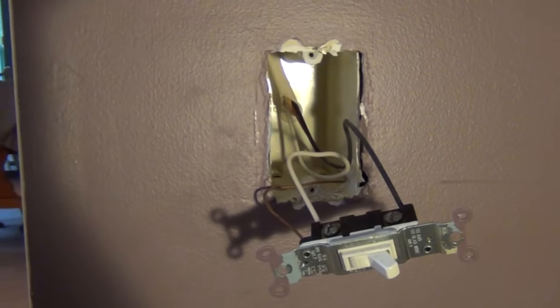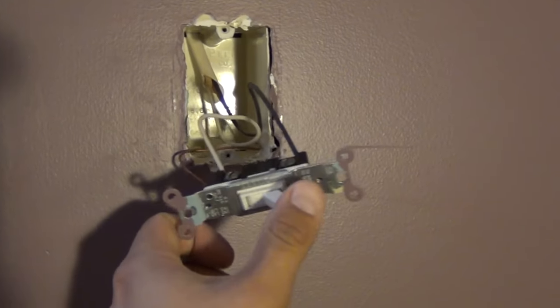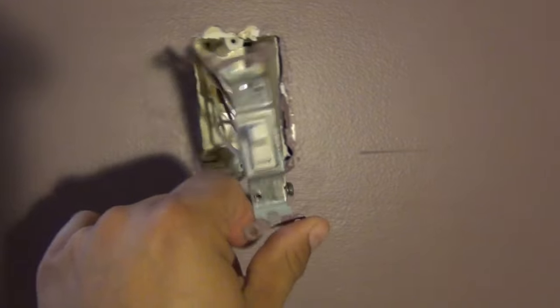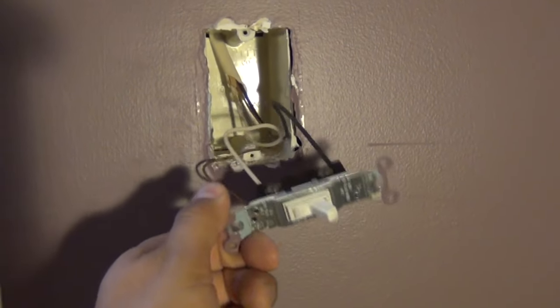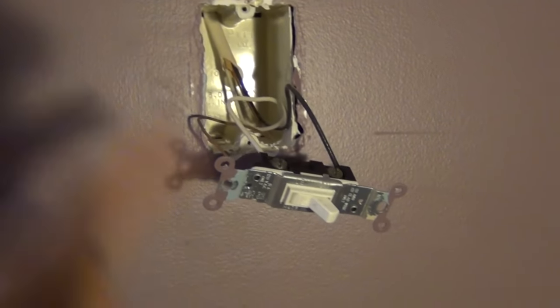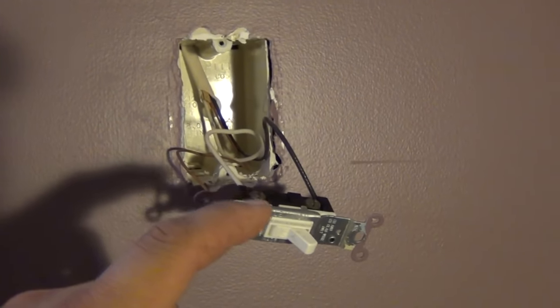So what exactly is the problem with the current configuration of this circuit? What we have right now is a single piece of Romex coming out of that outlet box down there. The way this works now is that this switch, when it's off or on, is controlling power down to that outlet. There's no lighting in the ceiling, and current code requires a switch in every room that could control either ceiling lighting or, in our case, an outlet. The idea is you'd have a lamp plugged in and the switch provides light in the room. A common way of doing this — because it saves wire — is to run a single piece of Romex between both locations, supplying 120 volts from the outlet box up to the switch, and then depending on the switch position it's either supplying or not supplying power back down to that outlet.